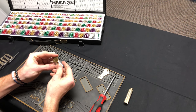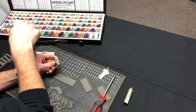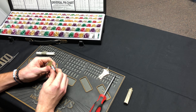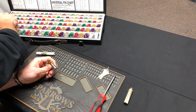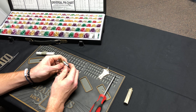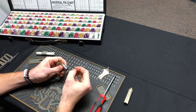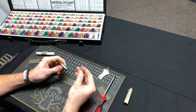Take your key and stick it into the cylinder. The first number on our key is a three — according to the Schlage table, three is a 0.210 pin. Put the pointy side down because these are Schlage pins and the bottoms come to a point. The next stamp is a five, which is a 0.240 pin — pointy side down. Next is a seven, which is 0.270. Then another three, which is 0.210, and last is a seven — go ahead and stick that pin in there.